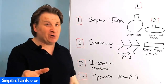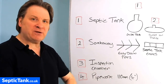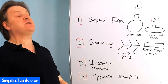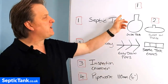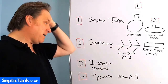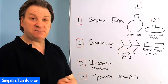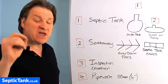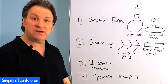I've been installing for 20 years, and these tanks — whilst they're good — typically take about three or four days to install because they're very big and very tall. You've got to get a large digger to dig a large hole, then backfill with concrete around them, otherwise they pop up out of the ground. So whatever you pay for an onion shaped septic tank, you've then got to add at least eight hundred to a thousand pounds on top in concreting costs.